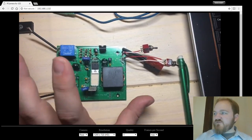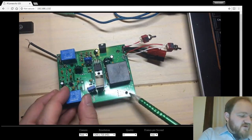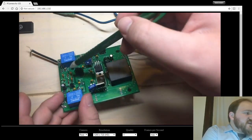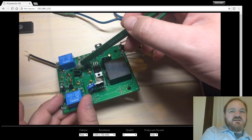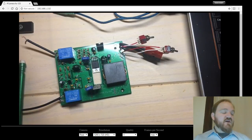But the sort of critical features on this, you can see I have three mounting holes placed a little bit arbitrarily, right? I've got one in the corner here, one in the corner here, and I've actually got one that's really snugged up next to this relay, which I'm not super duper happy about, considering how big that relay is. So that is going to have to move. So that thought that I'm going to move that hole later is actually going to drive a little bit of how I'm going to design this case later in Fusion, because I want to be sure that when I move that hole and the mounting point associated to it, all of the other geometry that I've built on top of it updates automatically, right?